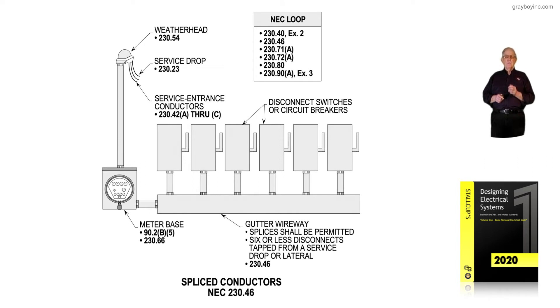If we had a large feeder in the disconnect to the right going out, and we splice with smaller conductors from that feeder, then that would be 240.21(B). Now look at the disconnect to the left — if that disconnect was protecting conductors routed in conduit over to a transformer, and off of the secondary side of that transformer you tapped with transformer secondary conductors, that would be 240.21(C).